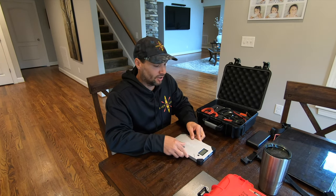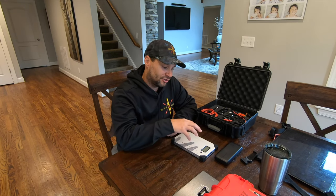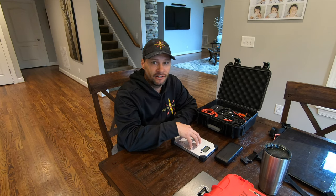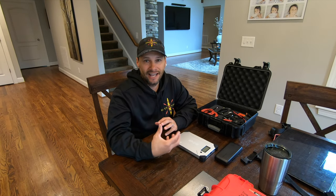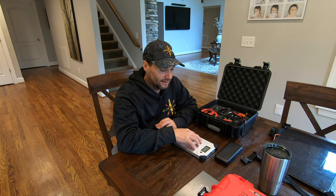Basically what I've told Brad and what I'll talk about is you need to figure out what your battery usage demands are. My main consumption of energy is my GoPro batteries. One battery is 1,500 mAh, which means I can do 16 full charges on here without ever having to charge this back up. So if I'm charging 6 to 8 GoPro batteries a day, I might have two to three days of keeping my stuff going without ever seeing the sun or getting a charge on this.